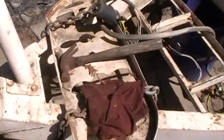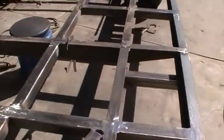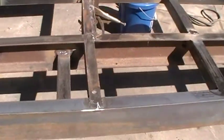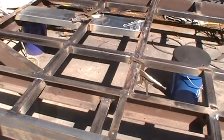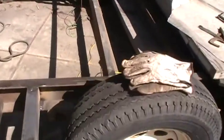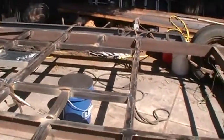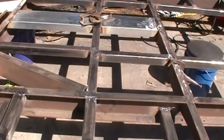What I'm going to do on the bottom is just like my other trailer — get an inch-and-a-half square tube and run it underneath from the front all the way back. I build my wings out and bring it all the way back. I just want to be able to carry 10,000 pounds on this. My other trailer was rated 5,000 pounds; I did a lot of upgrades, put 10,000-pound tires on it, boxed the frames in. I'll be boxing these frames in to make everything stiff and put eighth-inch diamond plate on top. Eighth-inch is the thinnest diamond plate you can get and it really needs a substructure under it, so most of this work is for the substructure and strengthening of the trailer to make it very, very strong.